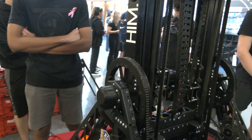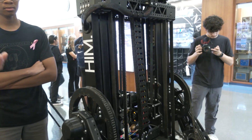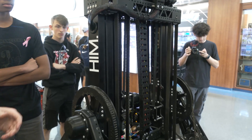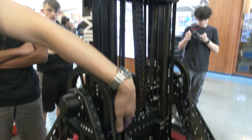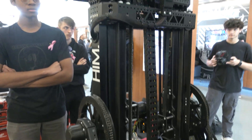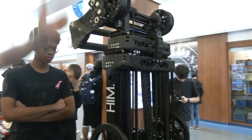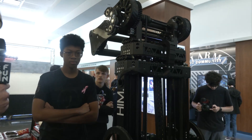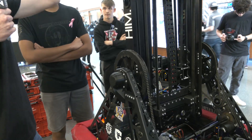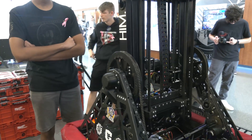Now for the actual cascade lift: we went with a belt design instead of chain because — and we tested it — the belt design was better in terms of cleanliness and overall reduced friction. The cascade lift works with blocks attached to metal beams, operating in a pulling motion that pulls the entire cascade up simultaneously and brings it all back down at the same time. For the A-frame pivot, since we extend so far out, we wanted to keep an extremely low center of gravity — that drove our whole cascade lift design.